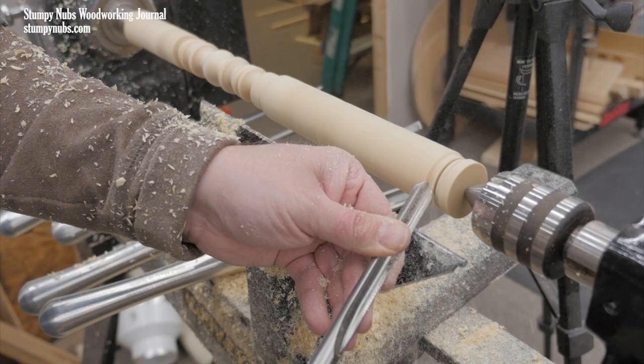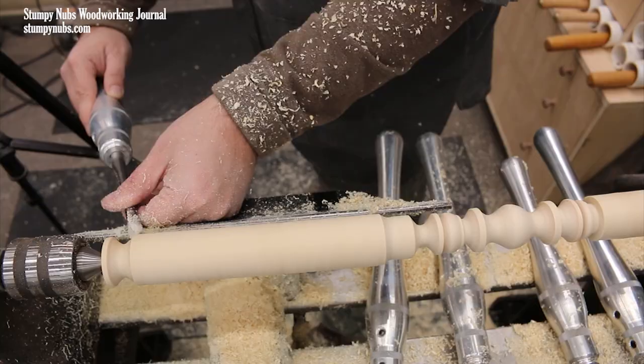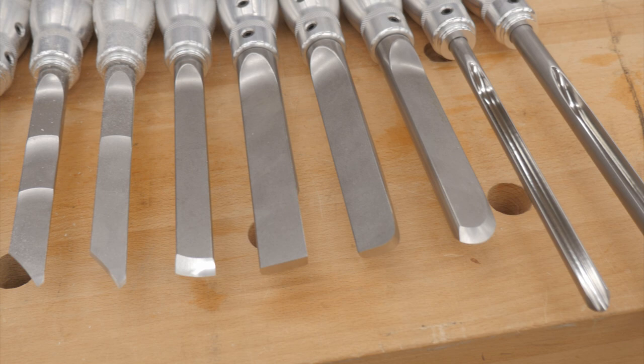There are of course variations of these, but pretty much all carbide tools are based upon these basic shapes, so it's easy for a beginner to wrap his head around what's available. Once you choose your tool, you just simply hold it parallel to the floor and push it into the spinning blank. It'll remove stock quickly and you are very unlikely to get a significant catch. Traditional beveled tools require more finesse. They come in four primary types as well: scrapers, gouges, skews, and parting tools. But there are many more variations of these.